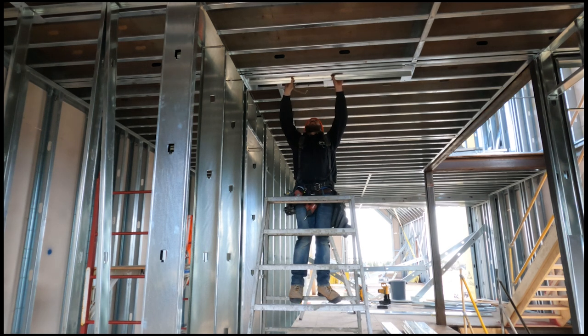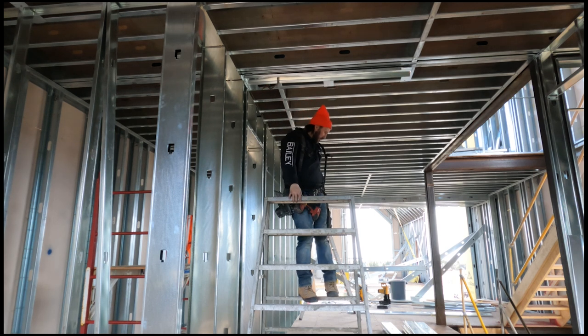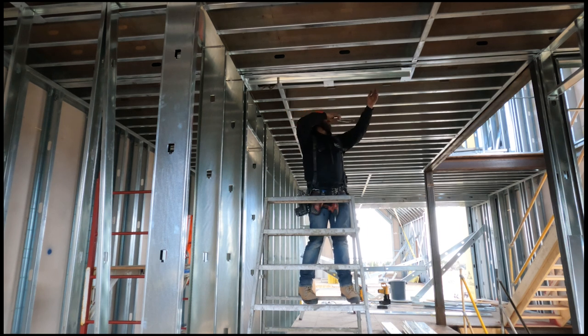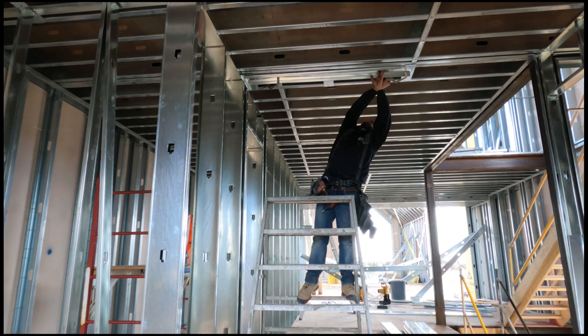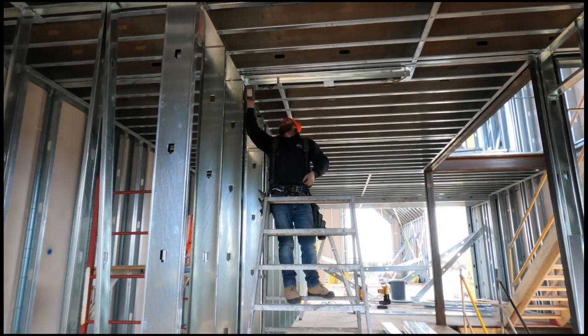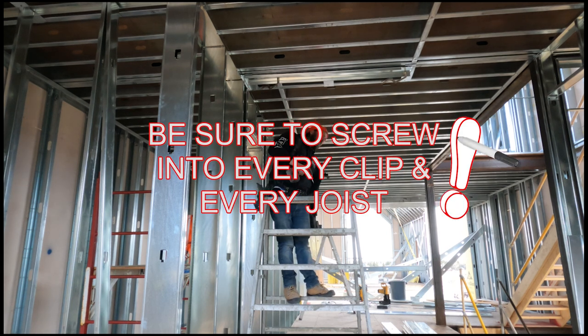This one here has no ledge because you don't always need a ledge. I've put clips on the ends — I put them every two feet and one on the ends where the corner will be. You don't frame your wall up inside the joist; you have to be at the same level as the floor joist. I'm using two pin lasers in this situation — one on the far end and one plumbing up the outside corner — and you'll see how it all comes together.